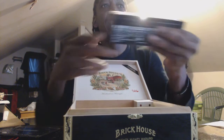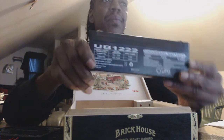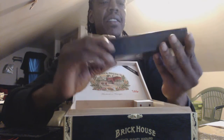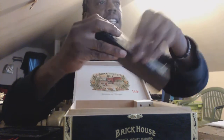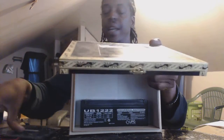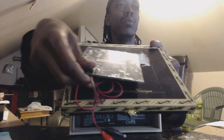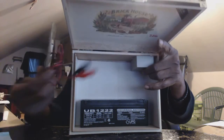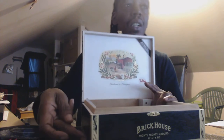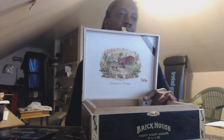The last element I need is the battery. I've got a sealed battery which is safe to go on either side, any orientation. I'm going to bracket this down within the box. So we'll have the solar panel on top, connecting to the charge controller, the charge controller connecting to the battery, and the battery connecting to the USB ports along the side of the box.